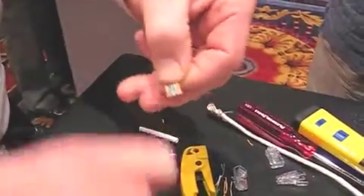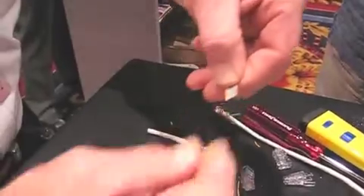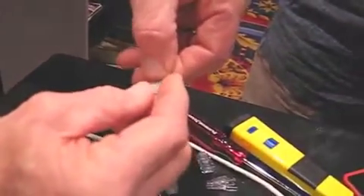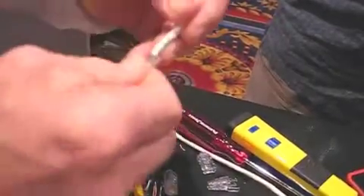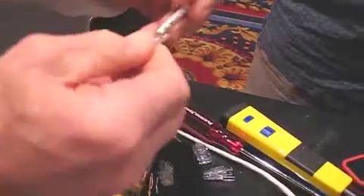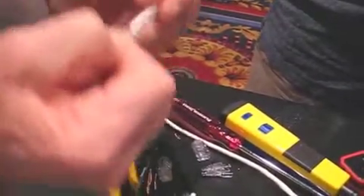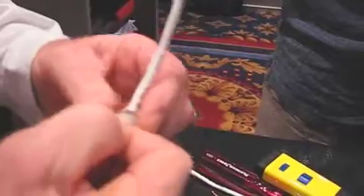It's perforated on the top side, and the jack is opposite, so I'm going to flip this and slide the bar on. And then what I want to do is get these twists, which are right at the end of the jacket, work them up above the bar and up to the back of the bar. The point of termination is right there, so your twists are actually like a quarter inch from the point of termination.